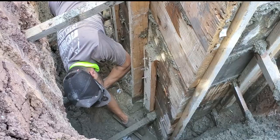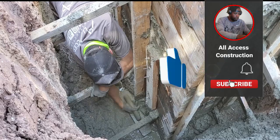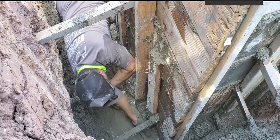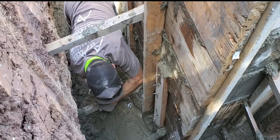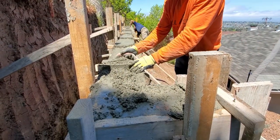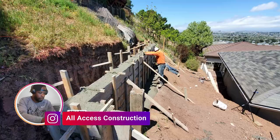What he's doing here is taking a hand trowel and going a little bit under the 2x12. This is going to allow us to strip this board pretty easily, and also gives us a nice little finish about 12 inches from the back of the wall for our drain pipe. Of course, with all our retaining walls we always make sure the top is nice and smooth.